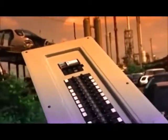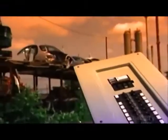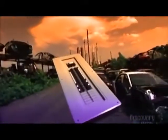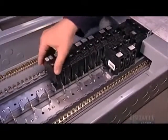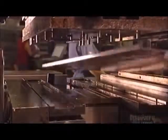The technical name for it is a residential load center, but people usually call it an electrical panel or circuit breaker box. This enclosed metal panel is usually built into an interior wall. It contains the circuit breakers that distribute, protect, and control the home's lighting and power. This load center consists of up to 40 circuits, each one having one or two breakers, and each breaker powers several outlets in the home.